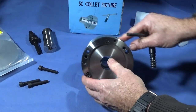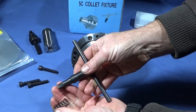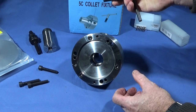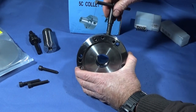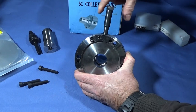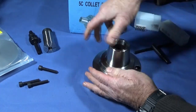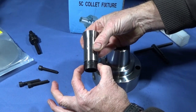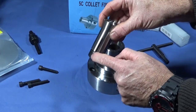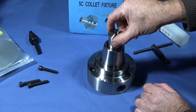If you're not familiar with the 5C collet chuck system, the way it works is with an ordinary chuck key. There are two positions on the collet chuck for winding the chuck. I take the spring off the chuck key - I find them very annoying and I'd never leave a chuck key in a chuck anyway. When you put the chuck key into the recess and turn it, you'll see inside the chuck there is a female thread in the ball which rotates. On the back of the collet you have a male thread and that locates in that thread inside the ball of the chuck.